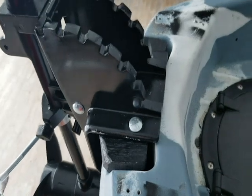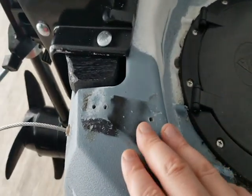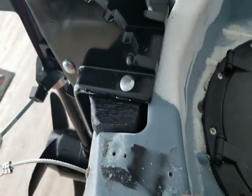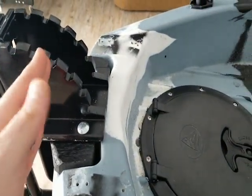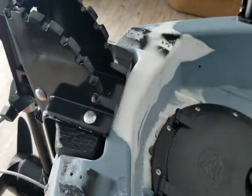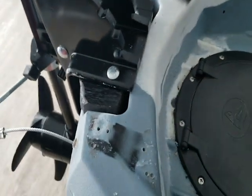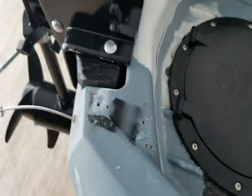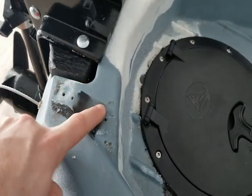At first, as you can see these holes here — I had a set of outriggers on here when I first bought the kayak. So I went into these holes and put L-brackets that went up, and then I had a piece of wood in the back basically acting like the back of a john boat. This just crimped right onto it and hung like a normal trolling motor. The issue was it was putting a lot of stress on the plastic right here, and I was afraid that if I hit something it could potentially damage or rip this out, because that was the only place it was anchored.